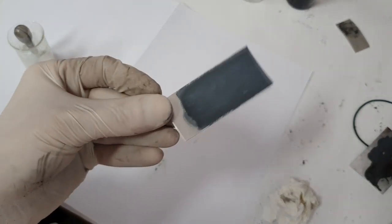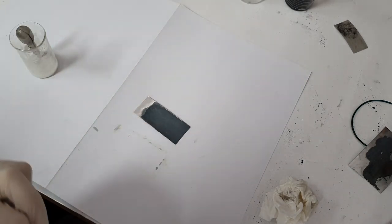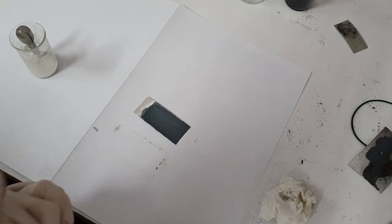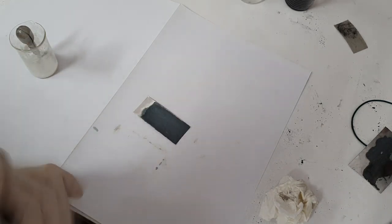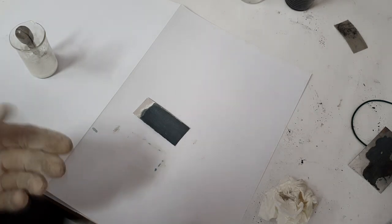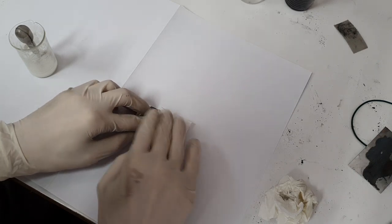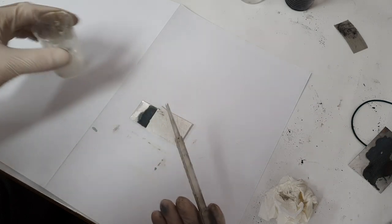This experiment I'm doing in front of you, so I don't know exactly what I will get. The plan is to see if I can make this battery rechargeable. I will make a simple battery — on the negative electrode I will put some separator, which is basically tissue paper, and soak it in the electrolyte which is potassium hydroxide together with zinc oxide.